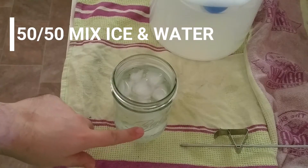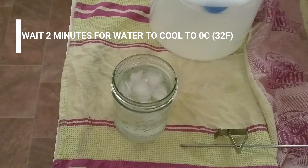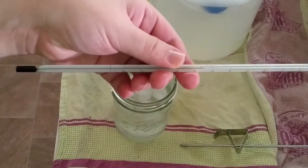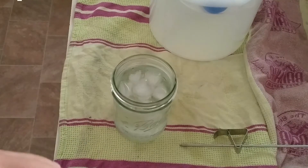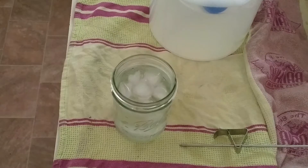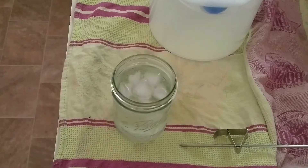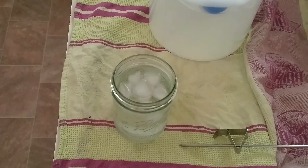What I've got here is a container filled half with ice and the other half with water. Let it sit about two minutes for the water temperature to go to about zero degrees, then insert your thermometer and let it settle. Once you get the final reading, you want to make sure it's between negative one and positive one degree - a one degree variance either way is acceptable. The other method is to put a pot on the stove, boil it, and check that it reads between 99 and 101 degrees Celsius.